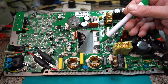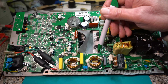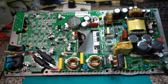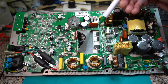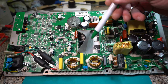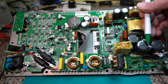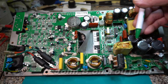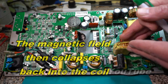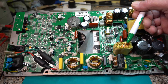As I've mentioned in previous videos, the common failure is this FET down here. On this board I've changed this FET — notice the different package — and nothing else. I did see on one YouTube video where someone changed this FET, plugged it in, and the light came on. How long that light stays on for is another matter, and I'll show you why. This FET pulls 240 volts — rectified and smoothed to 320 here — pulls 320 volts through this coil, through this FET, down to ground.